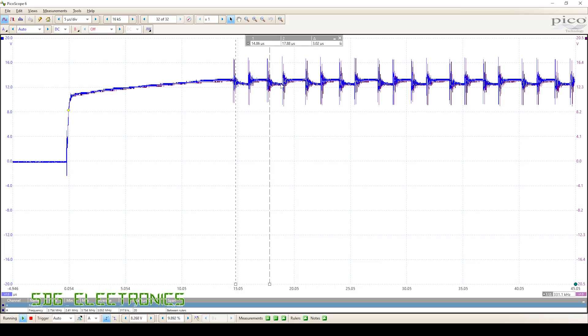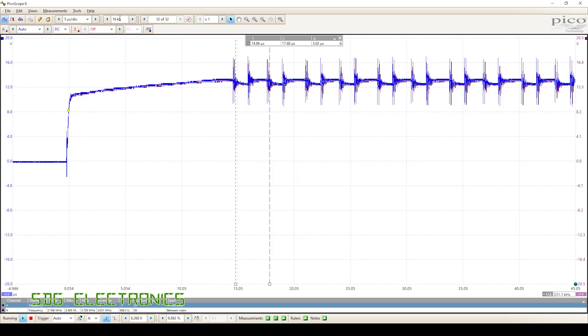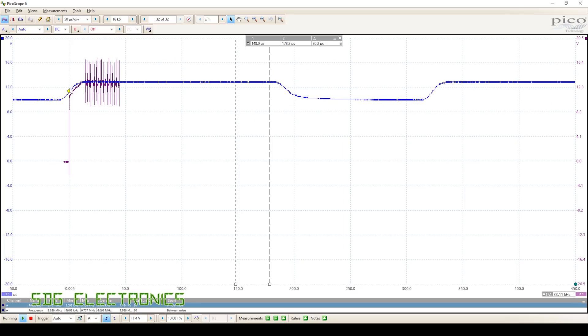Our capacitor is there to reduce the ripple in the LED. What we're seeing is a slight voltage change which, for a diode, results in quite a large change in current. As soon as we place our capacitor across those two pads, the ripple almost disappears — and there we go, a pretty much flat line. So the capacitor is having quite a large effect both on the ripple current in the LED and on any EMI emitted from the leads going to the LED — it is performing an important function. What might be useful is to see if an electrolytic capacitor will do the job, because obviously we're not going to get any tone from an electrolytic capacitor.